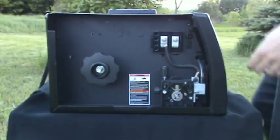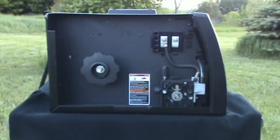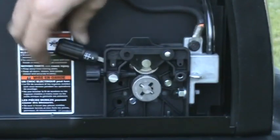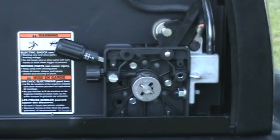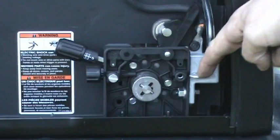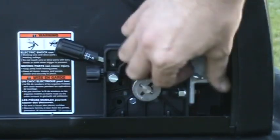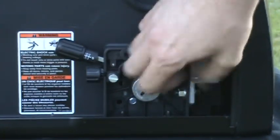For the rest of the setup we'll be working in the area behind the side cover, so open it now. If it has not been done already, release the wire feed mechanism. In front of the wire feed mechanism there should be a thumb screw. This thumb screw might also be in a bag of fasteners that came in the box with the welder. This thumb screw is what keeps the cable held in place. Make sure it is loosened or removed before attempting to insert the cable in the front of the welder.